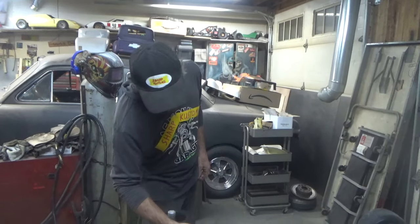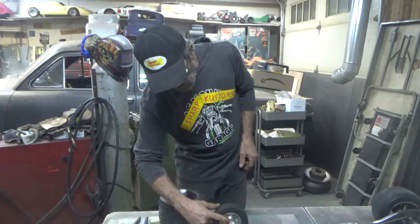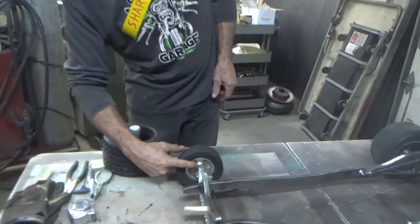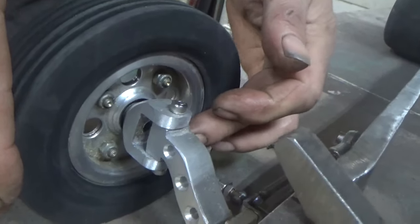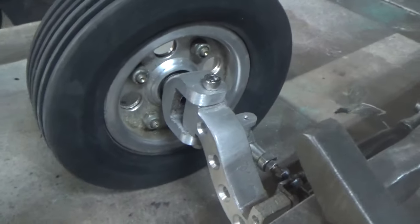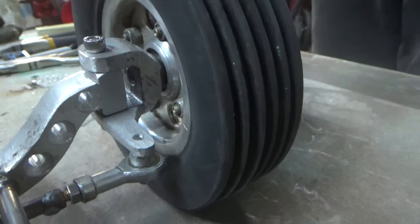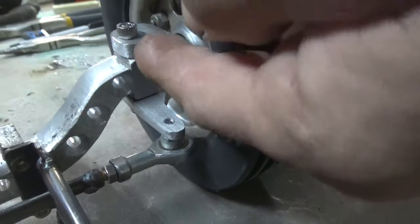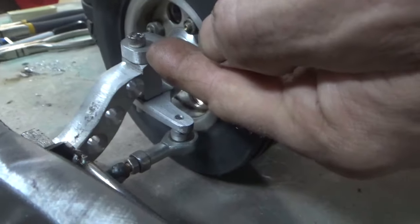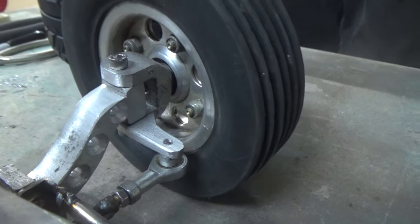Like I say, I made the spindles. The spindles were making a piece of channel like that in the styrofoam. Easy peasy, but I had to put this little dog leg on it, which was a separate little piece of styrofoam cut and glued to the big chunk. Then it was like, well, how do I pour these? I had to stand them upright with the dog leg sticking upward, and then I had another piece of styrofoam glued this way. I could put them together so I could pour them both at the same time. It was actually kind of cool.